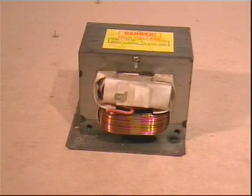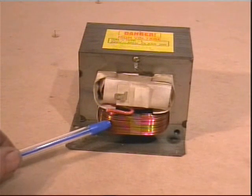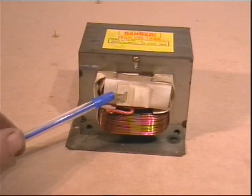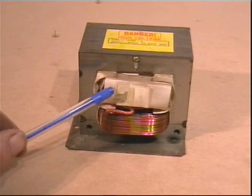Having stripped our microwave oven and salvaged many useful components, the most prized of which is the mains transformer. This is a typical transformer comprising of an input winding, the primary. It is usually at the bottom and made up of the heaviest gauge wire, as opposed to the secondary, the output winding, which is made up of many more turns and much finer wire.